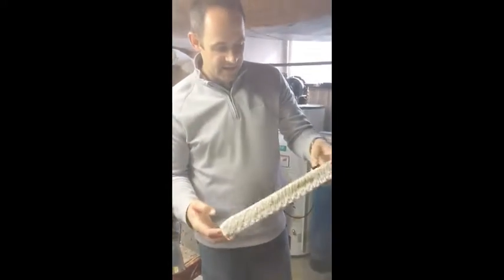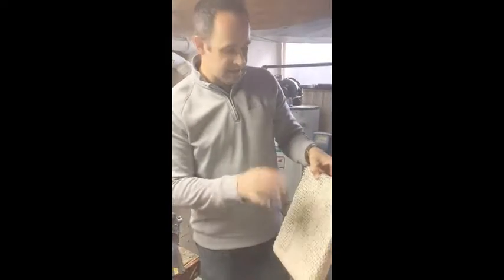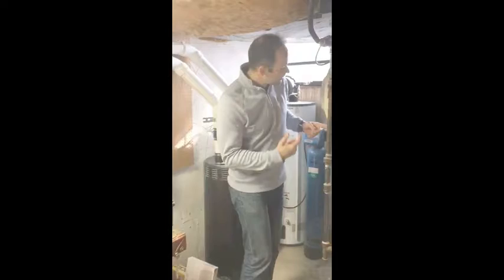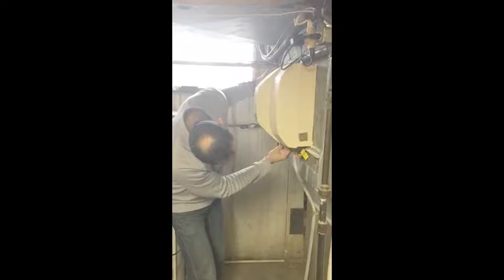That's not even wet — that's dry — so that tells you how much calcium is coming through our water systems and spraying into these filters before it hits our air to humidify it in the winter. These systems are only used in the winter typically.